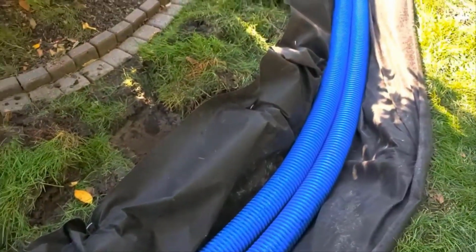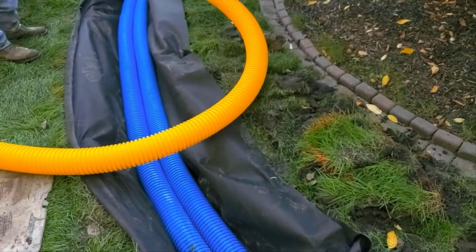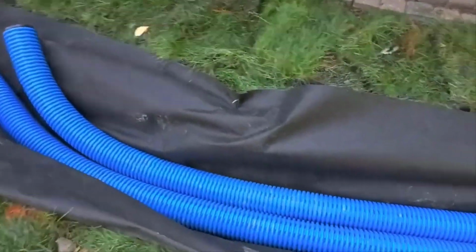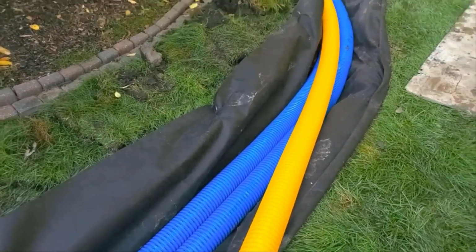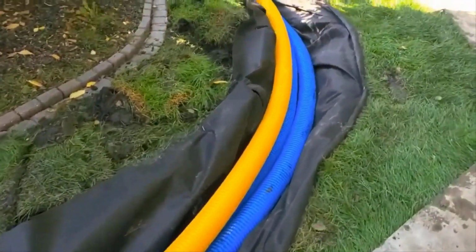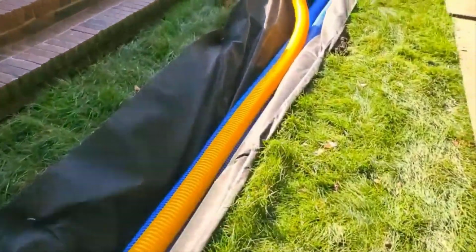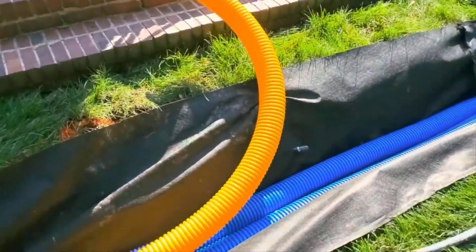So we love it because what we're finding out is not everybody's getting good washed stone, and they're cutting corners. They're cutting corners because washing stone costs a lot of money to put stone through a wash plant. So people are getting stone that's already kind of compromised. It's got dirt in it. Even we have been getting stone, that's why I know, and it costs a lot of money in diesel fuel to run a wash plant. So if these guys can sell you the stone at the same price and don't have to put it through that last step, they save a small fortune.